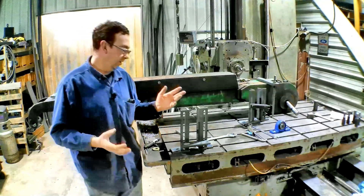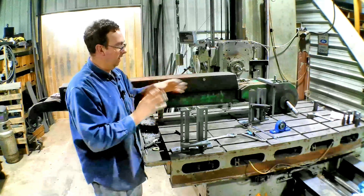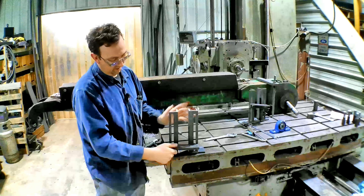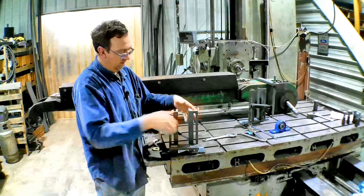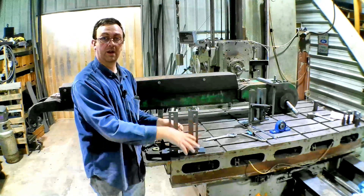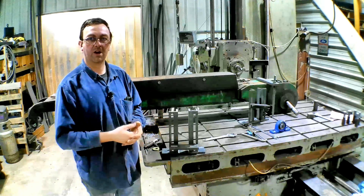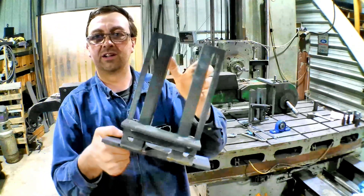In my last line boring video, I set up my bearings using the threaded rod and everything, and I was getting a lot of movement. So I came up with this idea — this is basically a tailstock that the bearing can bolt to, and it also slides up and down and bolts to the table. I made three of them so I can have three different supports. It'll take my inch and a quarter and my one inch bearings easily, and I've got more in mind to build that'll take up to a two inch bar, a two inch bearing. This was something I came up with fairly quick to get the job done.